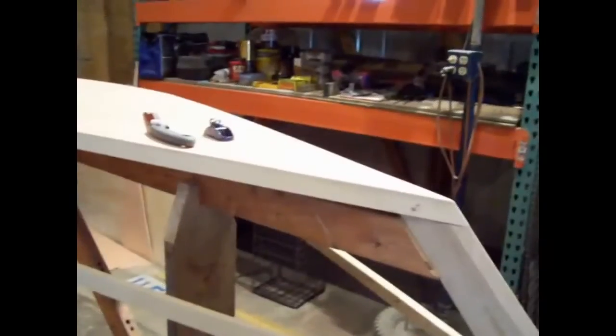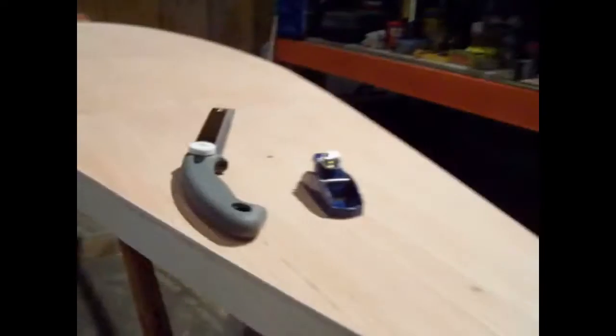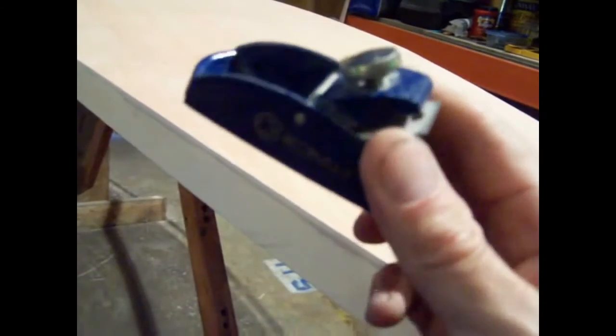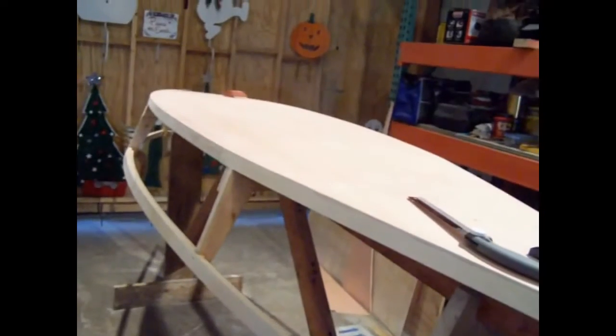That'll be the next thing. We got the bottom of the boat on there — I left it a little long. I rough cut it with a Japanese hand saw I bought; it's real thin, razor sharp, and it cuts on the back stroke. Really a slick little saw that I didn't want to buy in the first place but I wish I'd bought it years ago. Then once you do your rough cut you just hit the edge with a little plane — I've got a little cobalt plane. That's about the first thing that's worked great on end grain. So we got this all on and we're getting ready to start on the side panels.